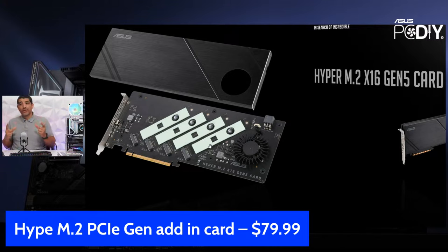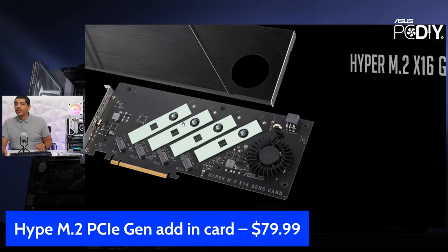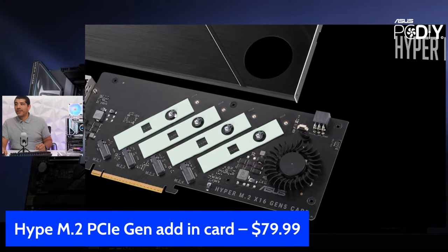And then there's also the controller. Those can, of course, all produce their own levels of heat output. And so this card design will allow for better thermal dissipation performance from essentially the top and the bottom. So there are actually thermal pads on this top milled heatsink here, and then on the card itself. You'll also see that we obviously have integrated here the M.2 Q-latch design.